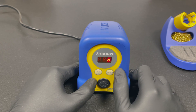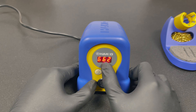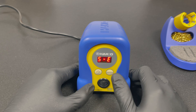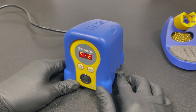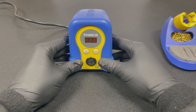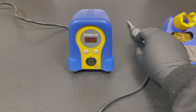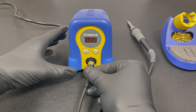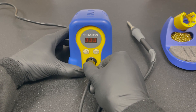After changing all the settings you want, hold enter for two seconds and you'll see Y for yes or N for no to return to the temperature display. Because the soldering iron is not connected it displays a sensor error, meaning something is wrong with the tip or it's not plugged in. Now let's grab the soldering iron and plug it in — it goes in with six pins and a notch on top. Carefully slide it in without bending the pins; once in it feels pretty sturdy.